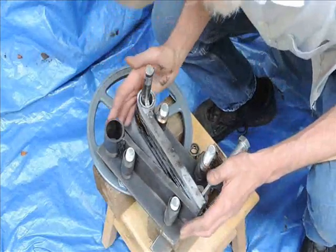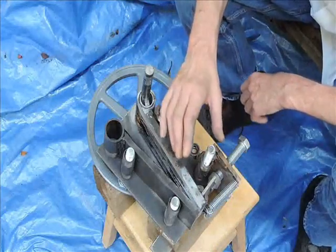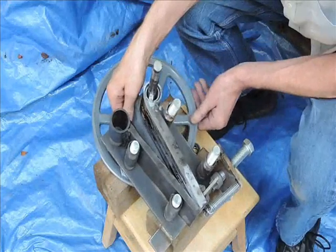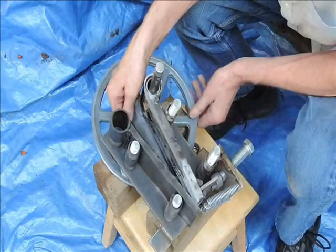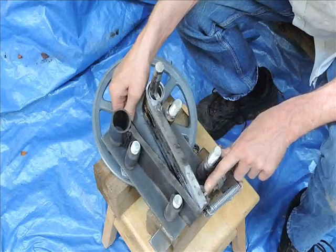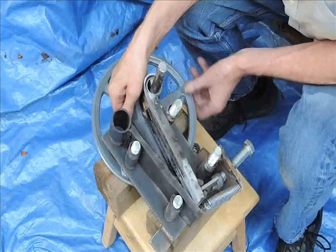Here, what I've done is I've managed to pull the side plate off without everything falling apart — at least we'll hope not — so you can get an idea of how this is set up. If I lift this slightly, I may be able to turn it without it self-destructing, actually in this direction. Normal action is down, crushing, then back up. And you can see the adjuster is set between two welded 3/8 inch rods. It's got plenty of free play, and it rides inside the channel.